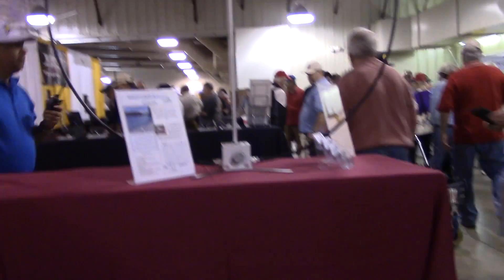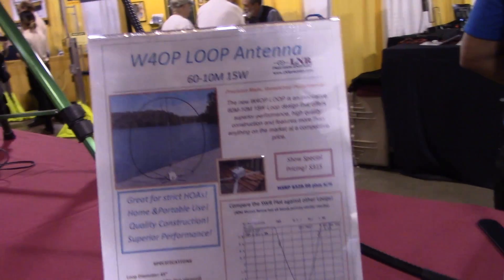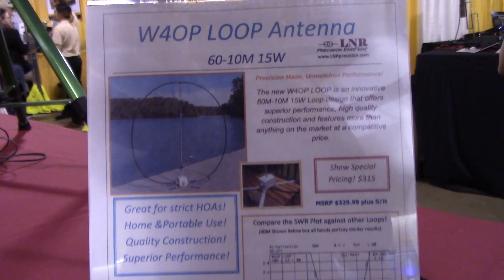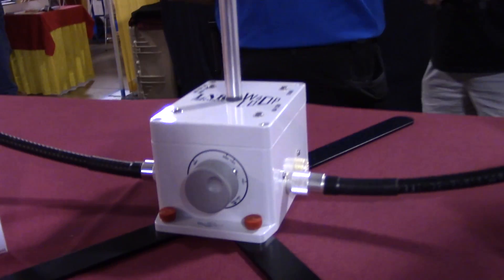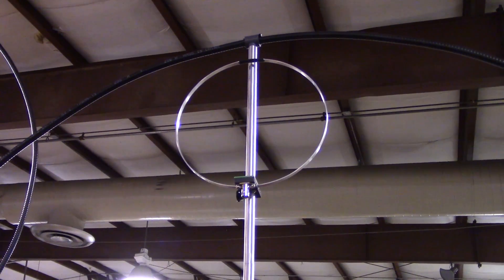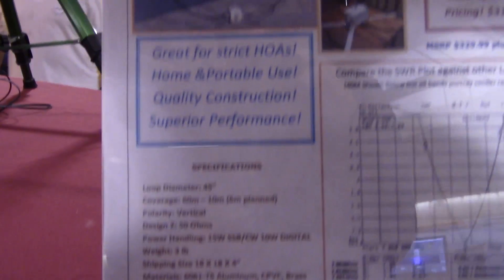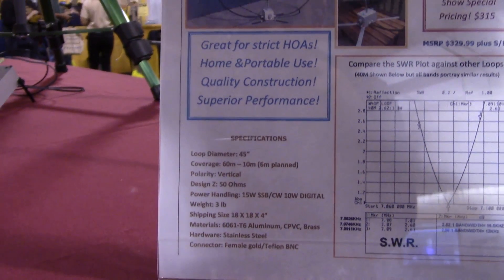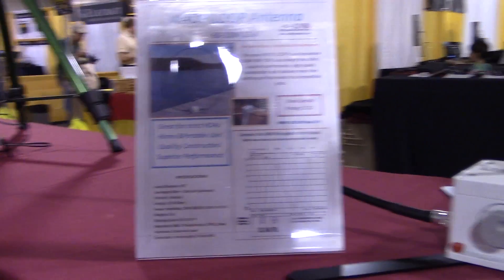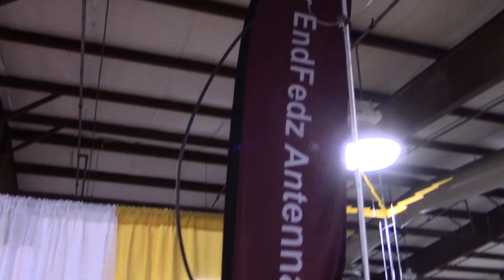This is a Dale Parfit design that he's been working on for several years, and it's finally come to the finished product. Ours is a little different in that we focus on performance. We use hardline versus some of the flexible options. We have an adjustable coupler, which some of the others don't have, which really affects performance and gives us a real good sense of how we control the SWR in the tuning. It does have a 6-to-1 butterfly capacitor, just like most of the other units. With the extra effort we go into with the hardline and the machining to reduce the amount of loss, we feel we're at the optimal performance of the loop.